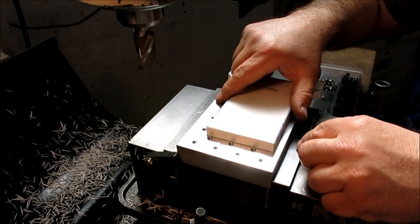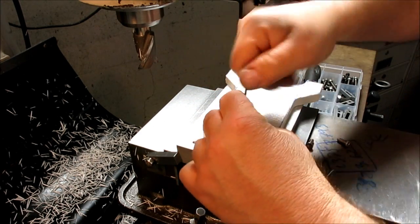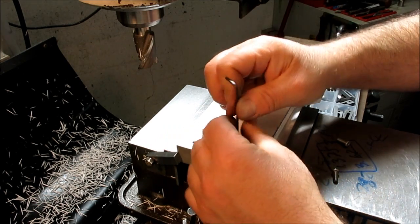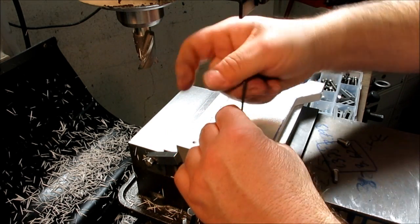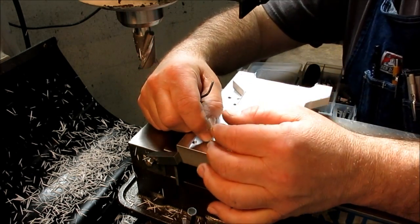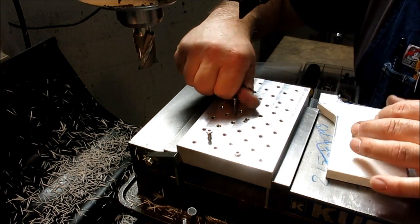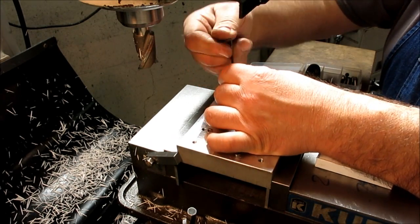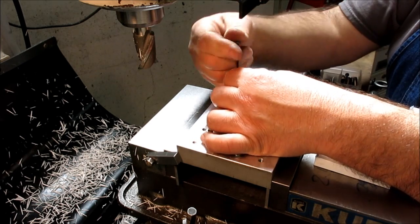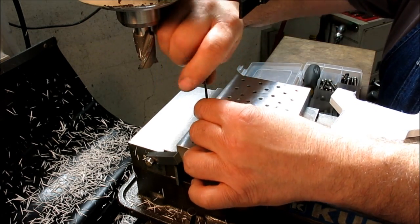Well, the mini pallet's certainly getting a workout today. What we're going to do is drop our little stop screws in, and those are just low head socket head screws. I'm going to put one there, and that'll be the stop in this direction. And then put one there. Put one there, and now these will be our kind of location fence here. I've got to get some shorter ones of these little low head guys, because they always go in just flush like this typically.